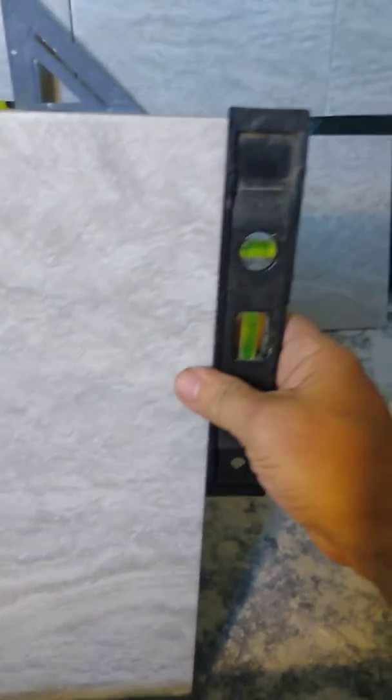And this technique applies to whether you're doing stairs, on a staircase. It's the same process because it's an angle and you need to make it level, square, straight, and even, correct? All right, so I got to bring this up and get that level in the center. Now that's perfect, looks like, right there. But you see the bottom, you see this space I have here. So it looks like I have about an inch space. To demonstrate, I come over here to this corner that I'm pivoting on, and I take that difference off there, the space, whether it's 3/4 of an inch, we're just going to call it 3/4 of an inch, and we'll show you the process.